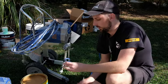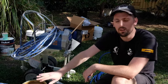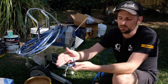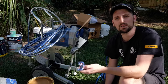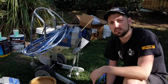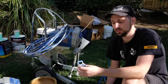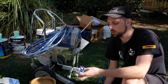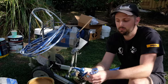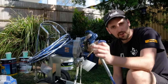Depending on what tip size you're using — standard with most machines, depending if you've purchased a Magnum DIY unit or entered the professional airless series, they'll come with a different range of tips and guards. The guard is a safety measure, because these airless sprayers do spray up to 3,000–3,300 psi. They are dangerous. If by any means when you're spraying paint you inject yourself with paint, go straight to the hospital — it's a serious matter. Make sure you always follow the safety instructions, relieve pressure in the system when cleaning up, and use gun trigger safeties so you don't accidentally trigger while changing a tip in a guard.